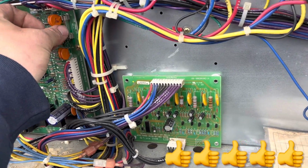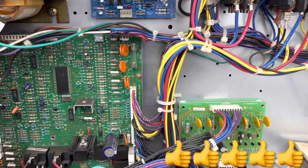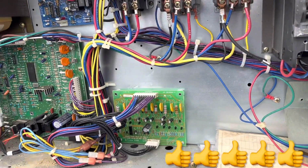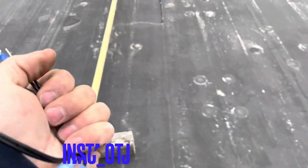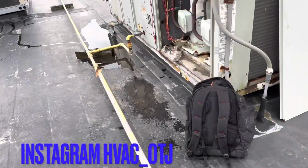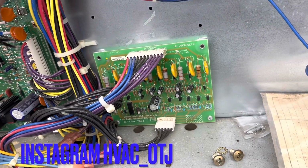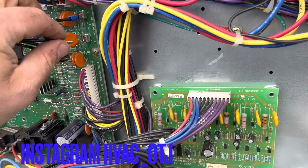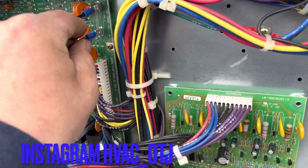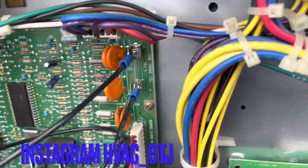That's only 1 amp, so what I'm gonna do temporarily, I don't have a 3-amp, is make another fuse. I could even put a popper in. Let me see if I have one. Or I can make a fuse. So I'm gonna take this 3-amp fuse with these male spades right here and put them in temporarily. Hopefully, let's see. This works. Like that.